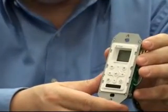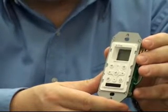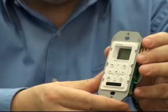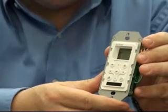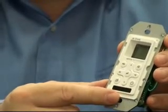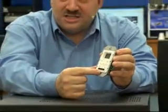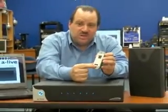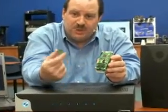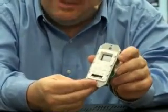With the controller, I have the ability to adjust volume, bass, and treble, turn on the zone, or make source selection. In addition, if I am streaming my audio, I can choose my selection from my digital audio library. Every wall-mounted controller has an IR pass-through. This is there to use the remote control of my analog device, such as a satellite receiver, a tuner, CD player. The back of my wall-mounted control is quite simple. I simply wire my Cat5 to this plug, make the connection, and mount it in a single gang box.